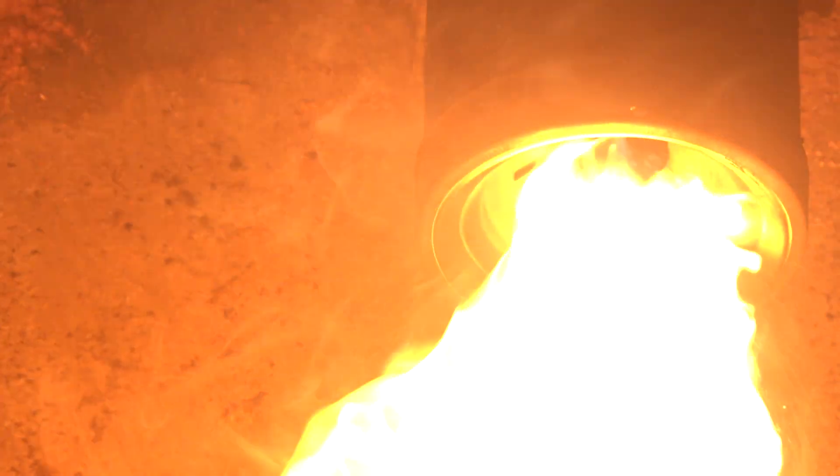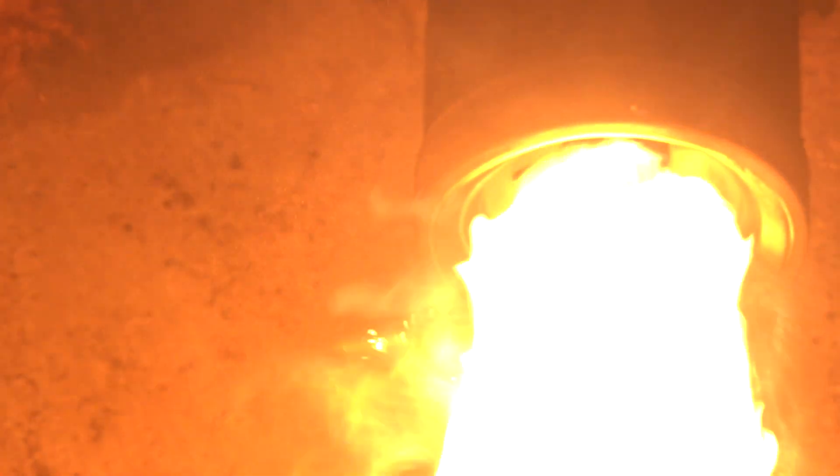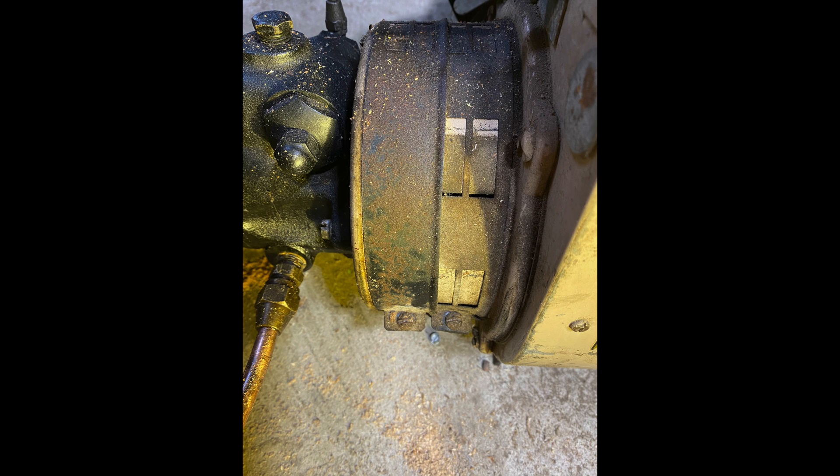This is despite the fact that I have the air shutters almost completely shut off on the conventional burner, while the flame retention head burner has them quite wide open. On the conventional burner, you can see that slide is just barely open — just the tiniest bit of air — and yet it's still got too much air to make a good burn. Oil furnaces need just enough air to clean up the flame; any more than that cools down the flame and reduces efficiency.